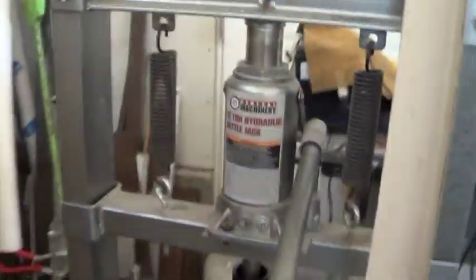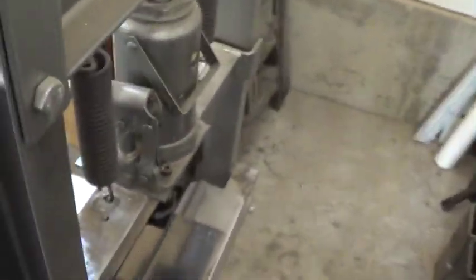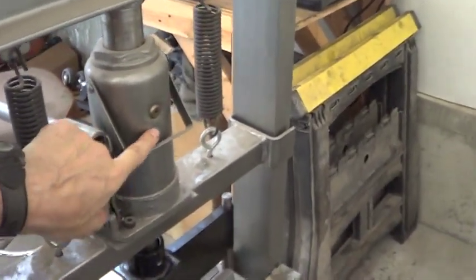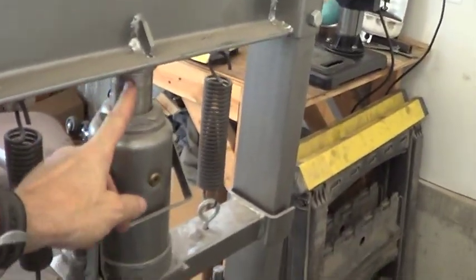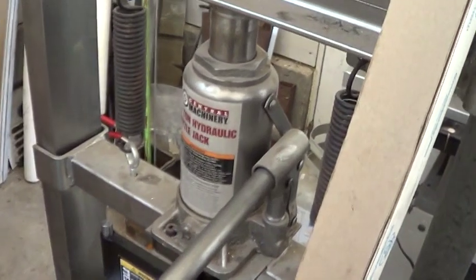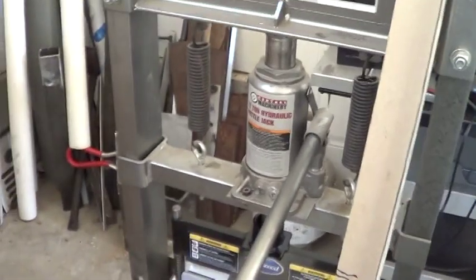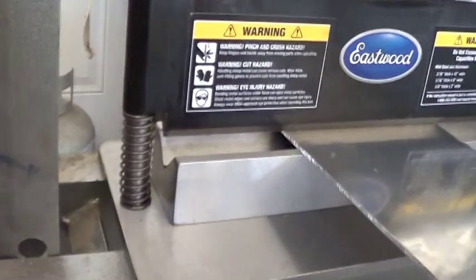This part is a tank that holds oil. You can see back here there's a plug — it's just a plug — and if you pull that out you'll find there's oil in this tank. Inside the tank there's a ram, and this thing is just a pump that pumps oil from the tank into the ram. They could have built this as a two-piece thing with the ram, the pump, and a tank off to the side, but it's just easier to put it all into one convenient little bottle. That's really what a bottle jack is.